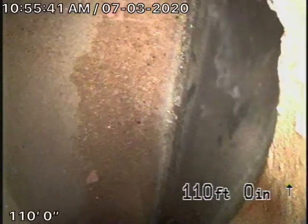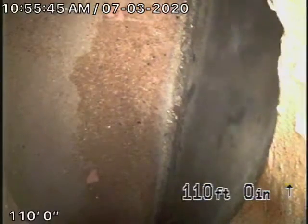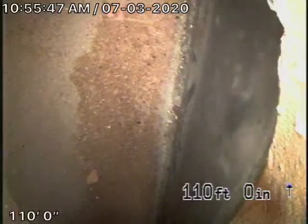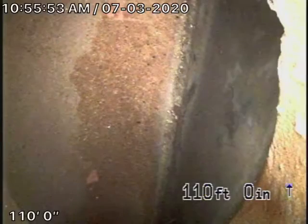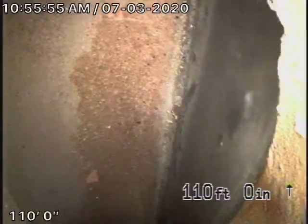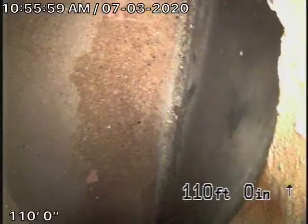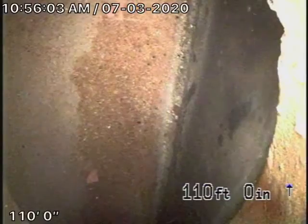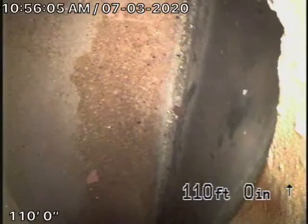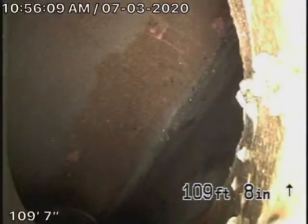When my guys were here, they loosened the cap underneath the house and found there are a lot of concrete foundations and footings in the way. So they ran a camera and located the pipe where it exits the house. It's much better that we have a clean-out out here anyway. We installed a two-way clean-out outside, which is really on the side of the house. Now we're running our camera downstream all the way out to the city sewer.